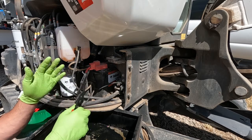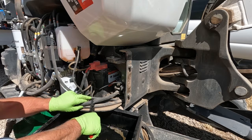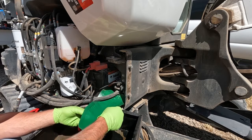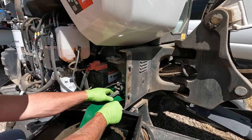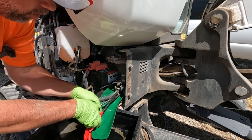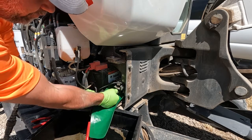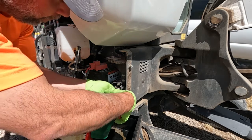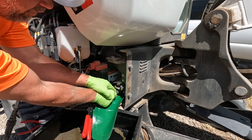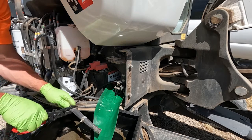What I like to do is use these hose pinch pliers — I use these all the time, and I'll leave a link in the description for the types of tools I use. I go ahead and pinch this hose off. Then I'm going to use my forma funnel — these things are really awesome too, I'll leave a link for that as well — because when I pull this hose off, some coolant is going to come out and I want it to go down into my drain pan, not into the interior of the machine. We've just got a little spring clamp here to take off.